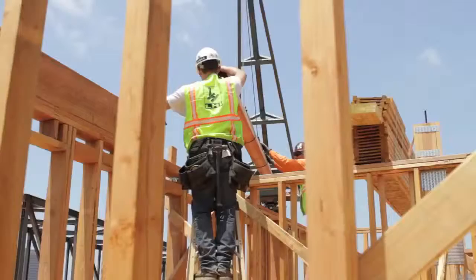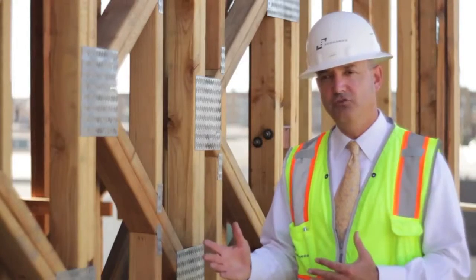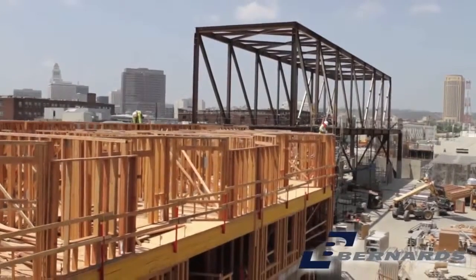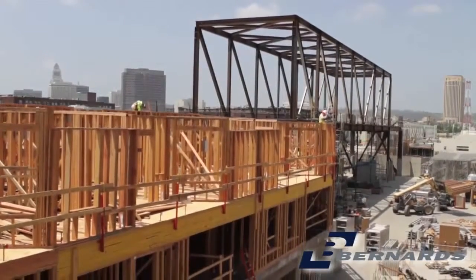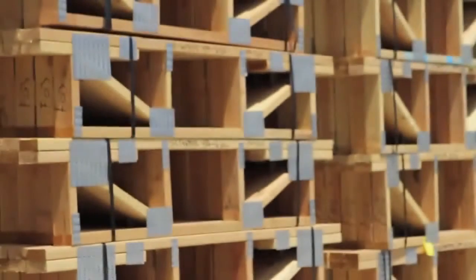The smart components are a laterally braced wall that's dropped into the building to resist lateral loads, namely seismic and wind, and it replaces a conventionally framed shear wall.